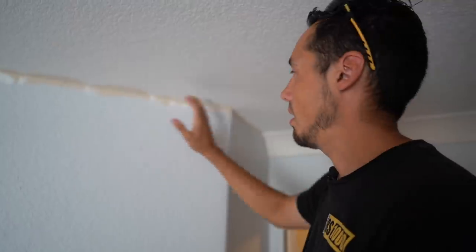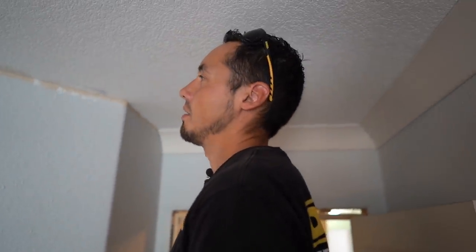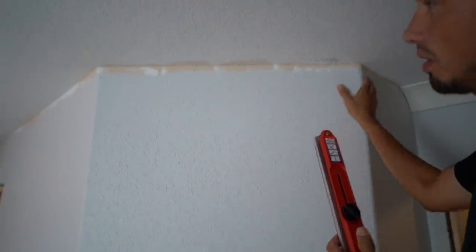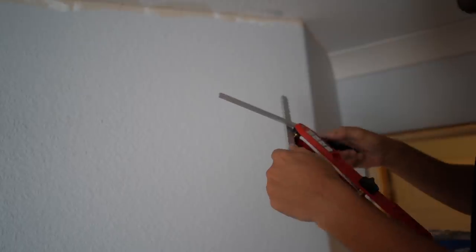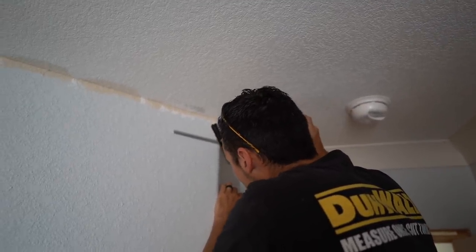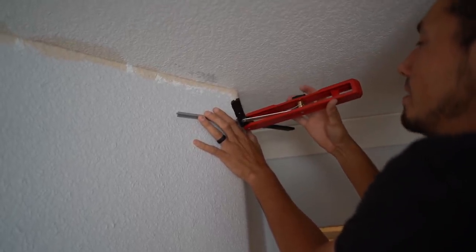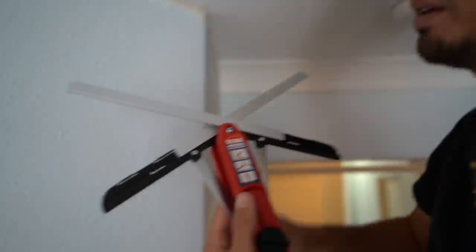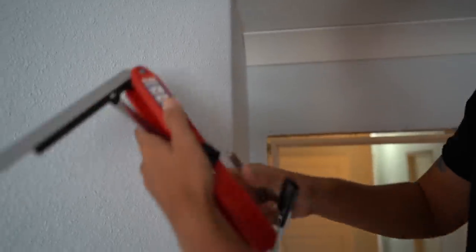Here we are up here. We've got two corners that are about 45 degrees, so we'd have 22.5-degree miters roughly. We've got this crown we're putting in — I've got this loosely in here and I'm just waiting so I can adjust it perfectly when I come with the next piece. Using this tool, we're going to wrap it around this corner. Since it's an outside miter, we raise these arms out and wrap it around this angle. I'm coming down four inches because that is where my crown wall projection is, so I'll get the most accurate reading there. I'll hold that up against there tight and tighten this down.